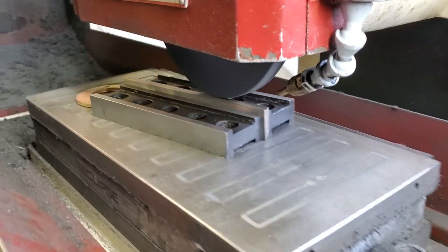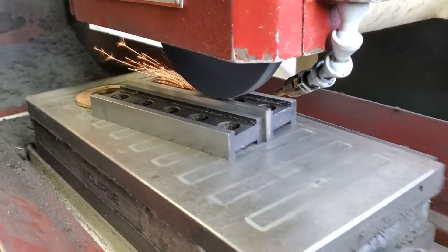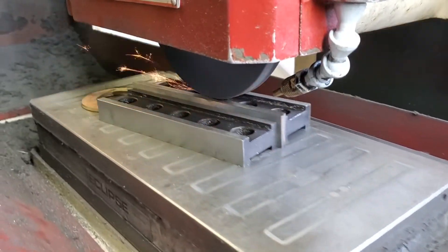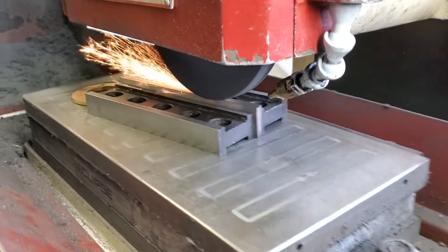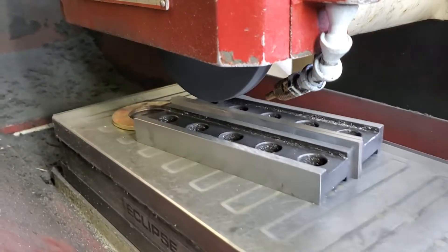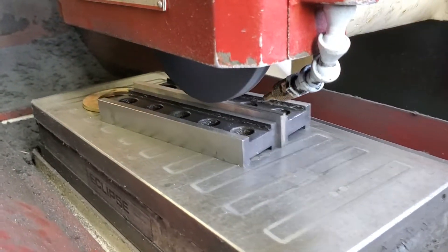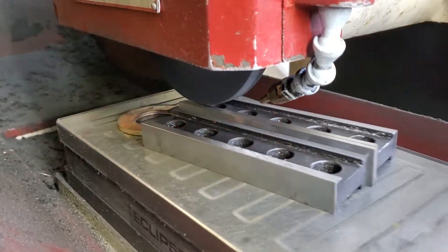This process is the rough grind, where I'm taking a little bit more material than I probably should, but I am going to go back and take some final cuts. What's not shown here is I did go back and take a couple final passes of a half thou before I took them out and measured them. This is important because I took the distortion from the heat out of the material, and I don't want to be measuring something that's distorted.